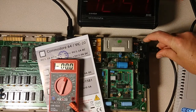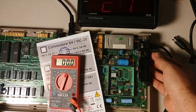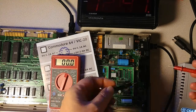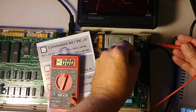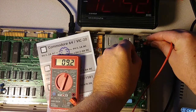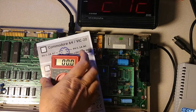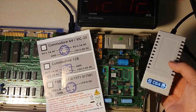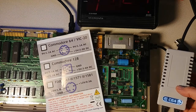Let's power it down and switch back to the original power supply. Power this guy up again — things look good. Now let's measure with the load, the machine on the old power supply. We're getting 9.2, 9.3 volts AC. So what I'm seeing is this new power supply is hot on the AC side — a couple of volts hotter than my original power supply.